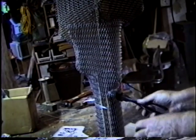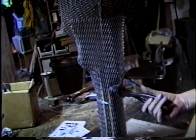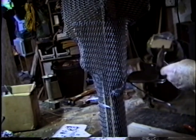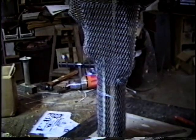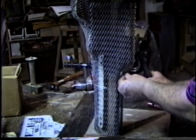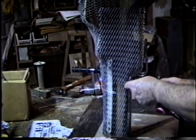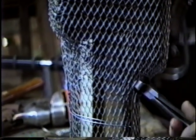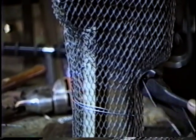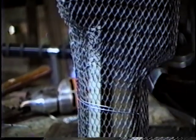One of the reasons for doing ferrocement sculpture, which I picked up from reading books on Pier Luigi Nervi's architecture, he was an engineer in Italy, and he was doing buildings with this technique, and he would use hardware cloth and rebar, and was spanning hundreds and hundreds of feet with free span roofs, just by doing 3/4 of an inch of concrete, just by the fact that it was so completely reinforced. He'd use 5 layers of hardware cloth and a row of pencil rod, but wiring it every 2 or 3 inches together was very labor intensive, and it's only really valuable in pre-war Italy.